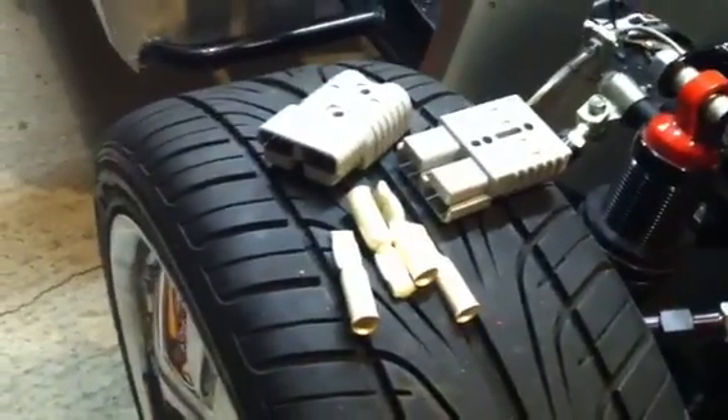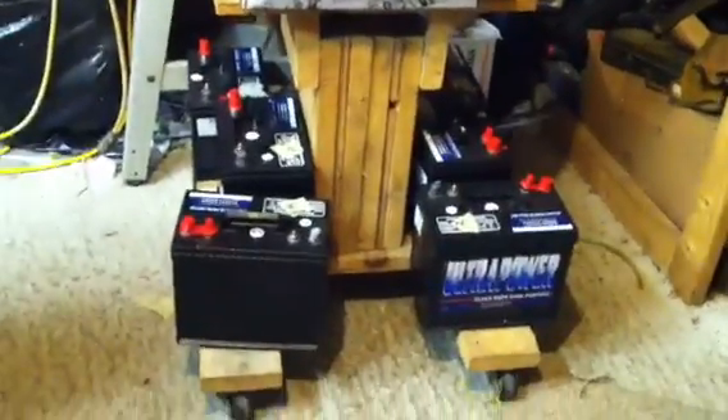For the moment I'm going to be using these smaller Anderson connectors — although they're not that quite that small. These are good for 175 amps, and that's going to tie this battery pack — this 6, 12 volt battery set — together as the temporary pack that'll go into this battery compartment area.